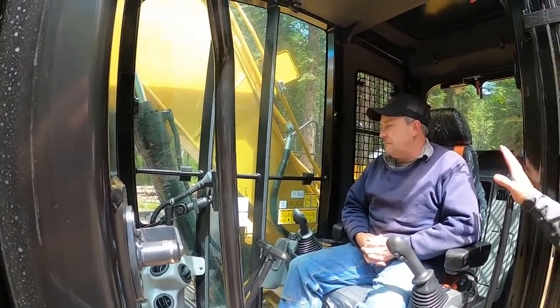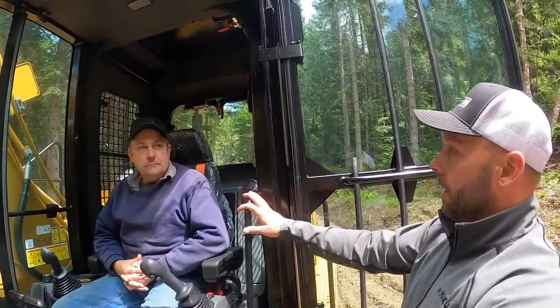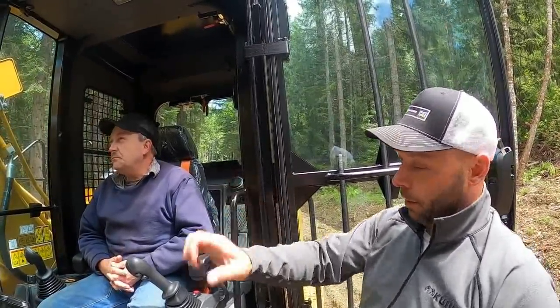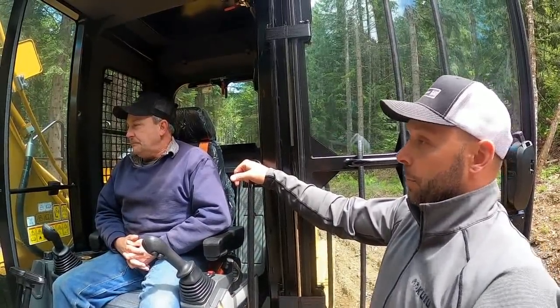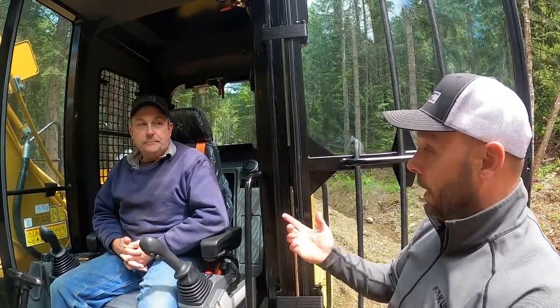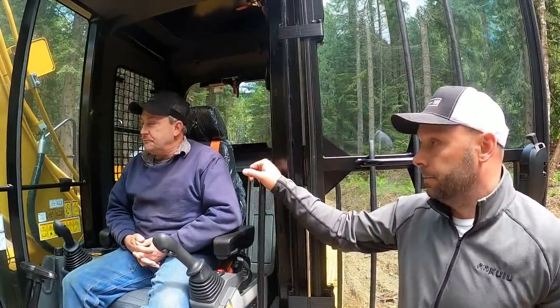What the Caterpillar trainers like to say is, we want you to do 3 movements of everything. Meaning, travel forward, travel backwards, travel forward, travel backwards, travel forward, travel backwards. And we want curl, and we want thumb, and we want stick, and we want boom. It's a good practice, but typically when you are doing your warm up now, you're doing your walk around or doing whatever you need to do and get your stuff ready. As soon as you get back into it, you're already doing a couple motions, right? You're going to swing, you're going to pull up, you're going to curl. Your thumb's probably closed at night, you're probably going to raise it up. It's just getting that oil through it, and you're off and running.